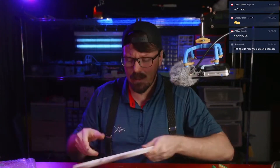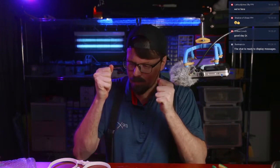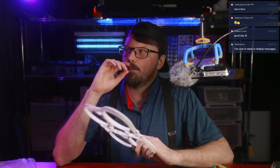As someone who knows a bit about injection molding, I can tell you this stuff is damn near almost as good as injection molding. Not better — it's impossible to be better than injection molding by the sheer process: two metal pieces coming together, hot plastic shot into every crevice, all air bubbles out, fully annealed — no layers, no binding, all one solid piece. That's simply the best. The type of plastic used affects it, but that's what's so special.